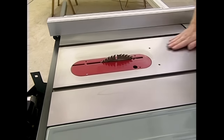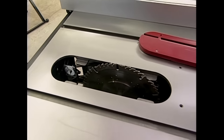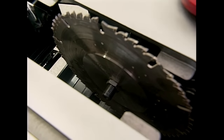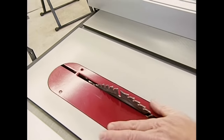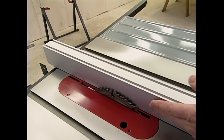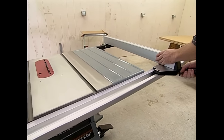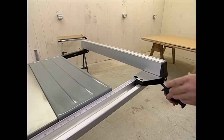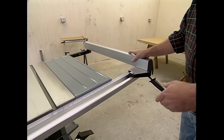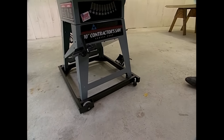A cast iron top is very durable and very flat. I want the arbor to be long enough to accommodate a full-size dado head cutter, and I want a really good rip fence — one that slides easily and when I lock it down, it's parallel to the blade. I like to have an extension on the fence. In this case I go out to 30 inches, which means I can rip a 4x8 sheet of plywood in half. And lastly, I like it to have it on a mobile base so I can move it around the shop when necessary.